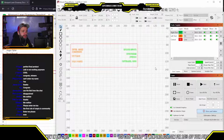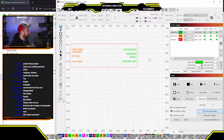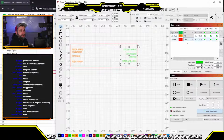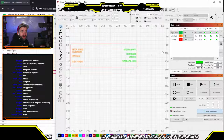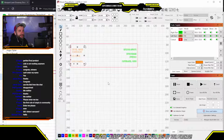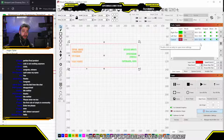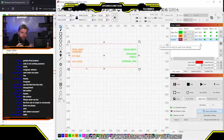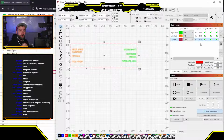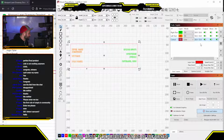Okay, also taking a look at this job real quick, you'll notice that a couple of these elements are different colors. And these are basically how you group things together within LightBurn, where you can engrave text. So for example, you see here the speed is 50 millimeters per second at 20% power. That is typically used on my laser for an engraving operation when you don't want to cut all the way through. And then same thing for this left text. And then finally the cutout, you'll see that the cutting speed is both slower and the laser is stronger. And that is done in order to make sure that once we engrave everything, we cut it out. And also important note is that we do all the engraving first. And then once we've done all the engraving, to make sure that everything stays lined up, then we do that final cutting operation and we end up with a name tag.